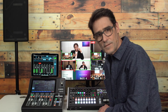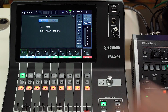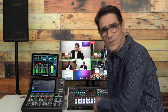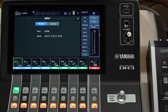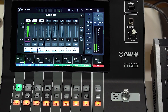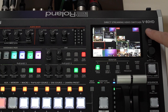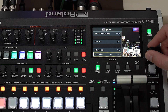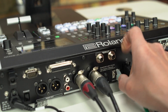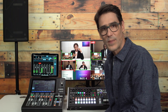First, check the firmware is going to be compatible and follow the manufacturer's instructions for updating. DM3 or DM3S, as either type is suitable, should be version 3 or newer to take advantage of the auto-mixer, though versions 2 and older will still work. The V8HD must be version 1.1 or later. Connect the network port of both devices to the same switch or same subnet and check their IP addresses are compatible.